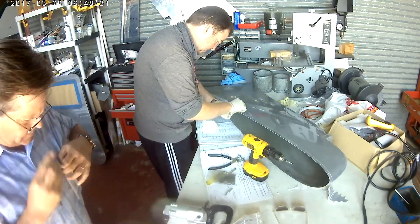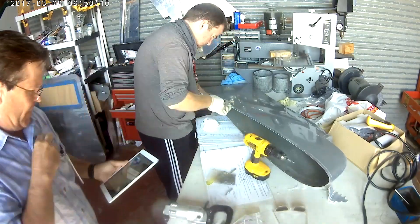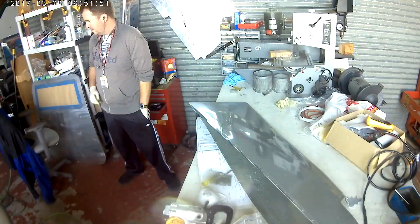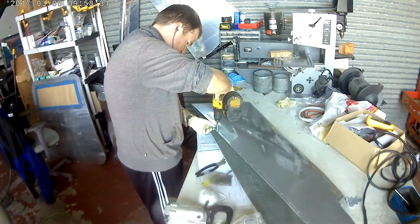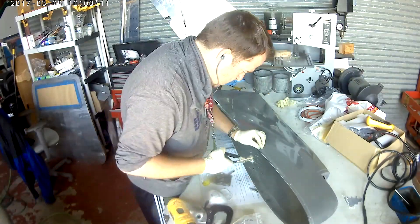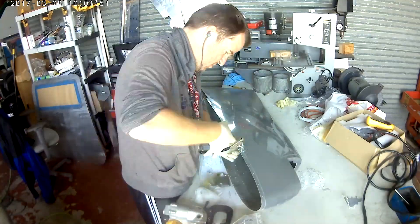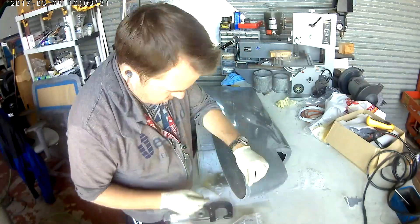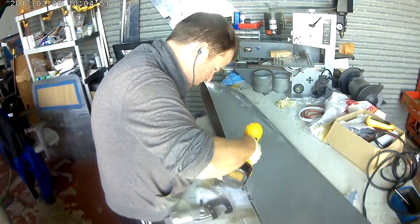After that, we'll actually go and drill the number 27s into the wing, and then later we will dimple those. After countersinking, you put the nut plates on the wing tip. You make sure that the holes in the wing are number 27 and that they're dimpled for a number 6 screw. Then you have to countersink the holes in the wing tip, because you want the dimpled skin to actually fit onto the fiberglass. You do that, and then the wing tip will fit simply in. Later I will show you some pictures — it fits great, just like the other one.